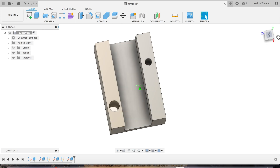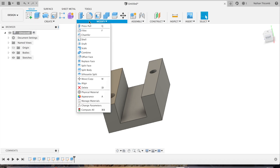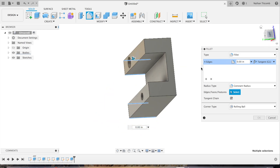So there's the start of our funky-looking part. Now it's time to machine it. Click on Design — first let's add some fillets on these sharp edges. We'll click on all these sharp edges and give them five to eight thou radiuses so it keeps them from creating a burr and keeps our customer happy. We'll go seven thou — that'll be okay.